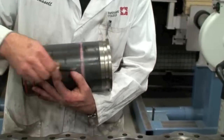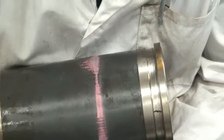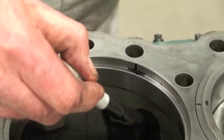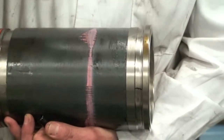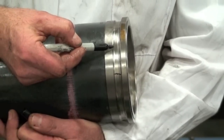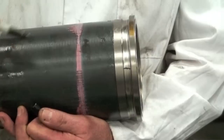On the top of the liner right here we have what's called coolant relief. If we look in the block right here, you can see a coolant passage that's cut in here that allows coolant to flow all the way around the circumference of the liner. That helps absorb and dissipate some of the heat from compression loading as well as combustion loading at the point of ignition in the compression ignition engine. This manufacturer has provided extra top liner cooling relief to actually help absorb and dissipate that heat.